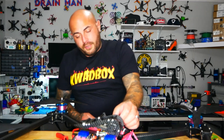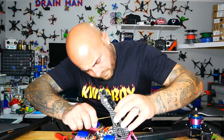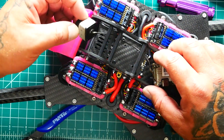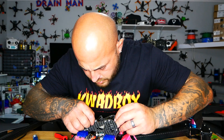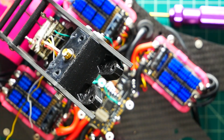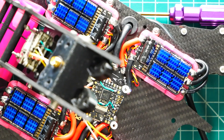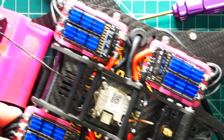I know you'd think with such a big drone you'd have plenty of space to work — surprise, surprise. So we drop this in and figure out how to mount it. The Vista has power. I use the DJI radio so I went ahead and put S-Bus and signal ground. The only thing left is a UART to get this connected, and I printed some tubes to hopefully use to mount the camera.